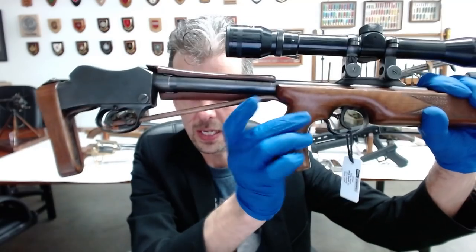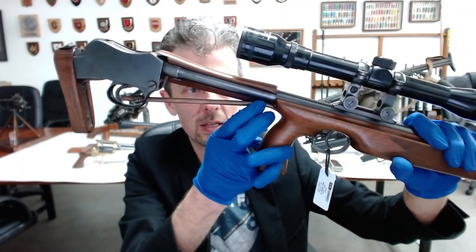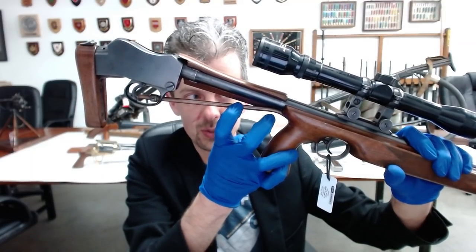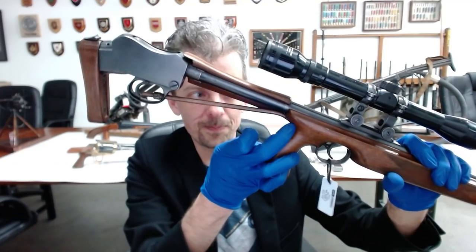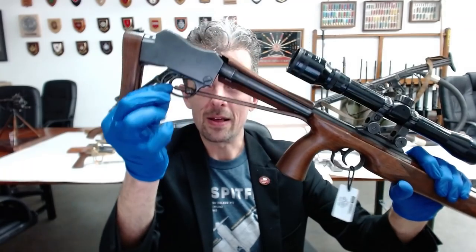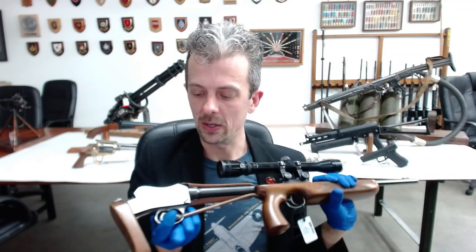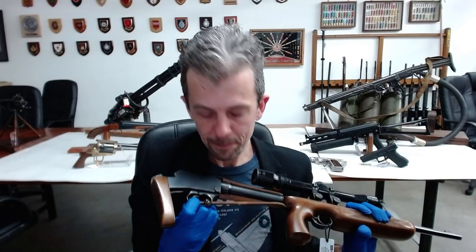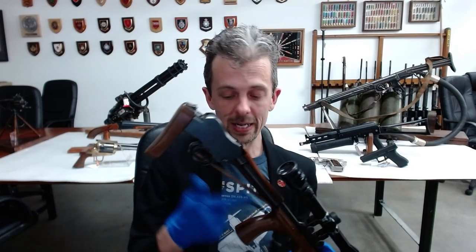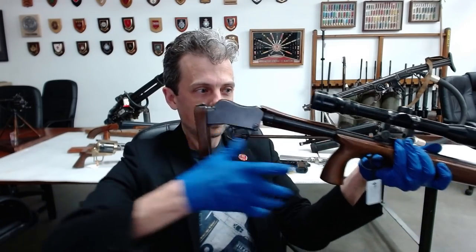Now, it might surprise you to see that the rod isn't moving in the obvious way, because if you've seen this from a distance you may be thinking this is a conventional stiff rod as you'd see in another bullpup. But the maker of this conversion has done something quite clever. This is a solid housing — a brass rod — and it has a pronounced kink in it, a dog leg, to take the rod around your hand so you can still hold it. That means you can put a heavy-gauge cable inside here and use that to push the trigger at the rear. In a properly designed from-scratch bullpup you'd have an internal sear, but in this it's all exposed. They've just drilled through the front of the trigger guard and put the housing and cable through there — so it really works like the brakes on your bicycle. I just think that's fascinating and a great illustration of how to create a bullpup.